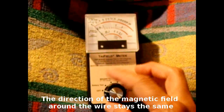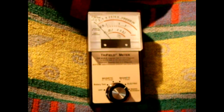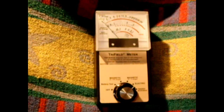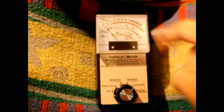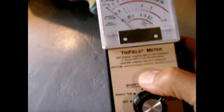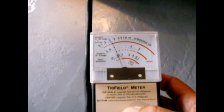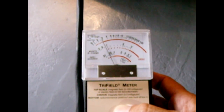Now if you put this over to the electric field setting, what this is looking for is voltage — that's all it's looking for. It could be lightning, or you could go to turn on your gas stove and the igniter would actually make this jump because of the voltage. Or you could take this and position it next to a wire — in this case feeding my drop light. If you position this right next to the wire, you can see it's detecting that electric field right there.